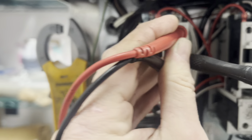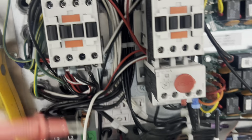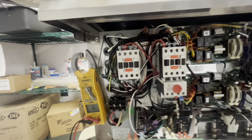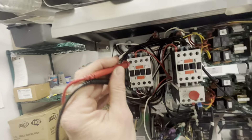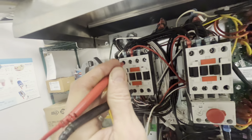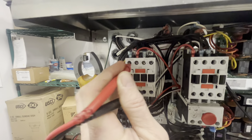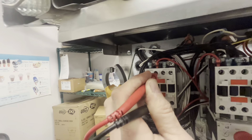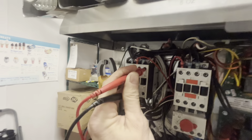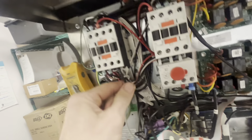We knew that, and line four is good — I just dropped the contactor. What I was trying to show you is that you think you've got continuity across, but the reality is I could go to one and two and get continuity because everything's rolling through the windings. I can go from one to three and get continuity. So testing the contactor: one is good, two is good, three is no good, four is good. I'm going to pull these wires, cut it back, and move it over to four.